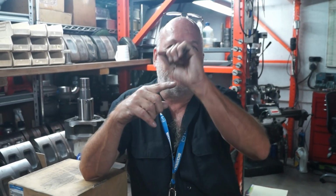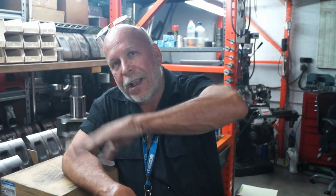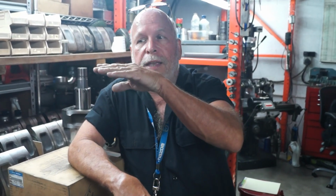in actual practice, that imaginary point of the top of that radius gets much wider, because the apex seal is constantly sweeping a certain amount of gasoline that's residual, that is in oil, that is stuck on the rotor housing. So the actual point of contact plus whatever it's dragging along or sweeping along becomes much wider. In doing so, the 3 millimeter apex seal is far kinder to the rotor housing.